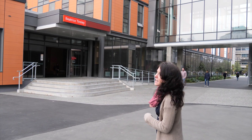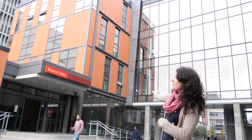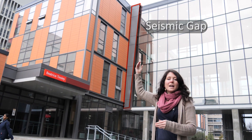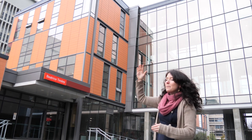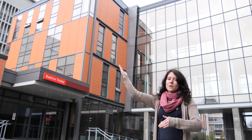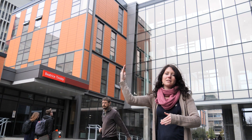One thing you'll notice outside the building is in this hallway connecting the two buildings - you'll see this little silver slip. As this silver slip goes up it gets wider; that's the seismic gap. So as this building moves in an earthquake, the top has more displacement than the bottom, so that's how much the building is allowed to rock without hitting anything else. On the inside is an accordion-like structure where the building can move back and forth and then come back to its initial resting place in the middle.